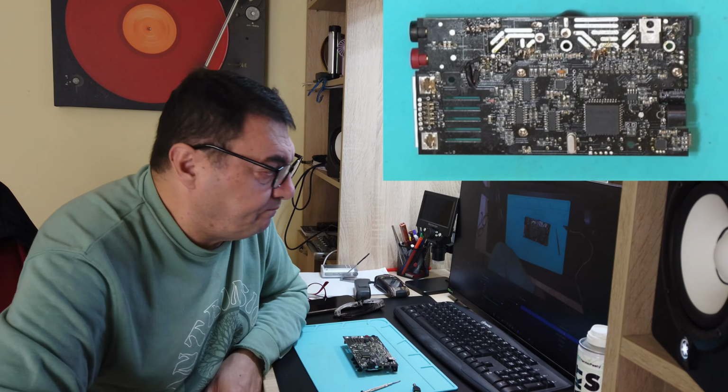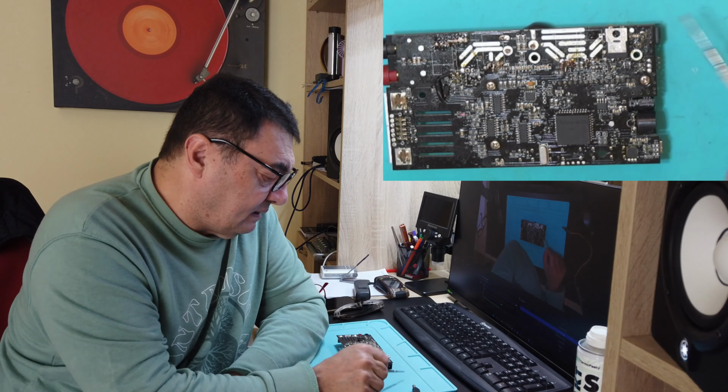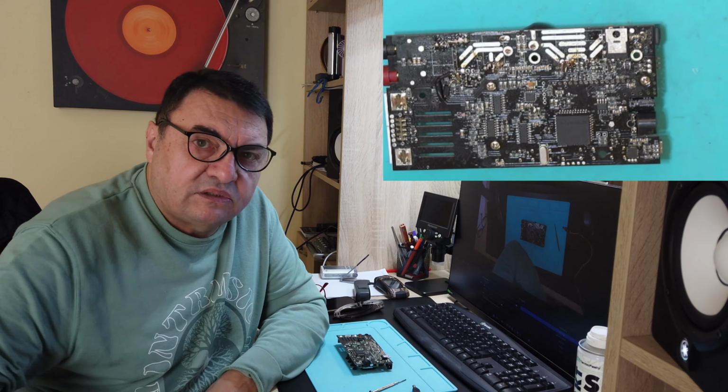This board from Charsoon Antimatter 250 watts, it's equivalent to the iCharger 106B and Turnigy Reaktor 250 watts. Same board, exactly the same board. So check for similar videos or similar documentation about fixing this connection break display. Don't jump to soldering things before having a proper idea about what's happening here. I found later that when you have an extra voltage or higher voltage than 18 volts up here, this diode is shorting, and that transistor is ruined. So I could have fixed it by being a little bit more patient, you know. Don't get excited. Do homework first.